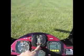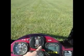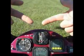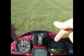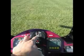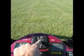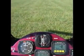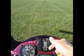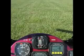Top center here is the combination engine and rotor RPM gauge. On the right is the engine RPM, on the left is the rotor RPM. The two needles work together and display in percent. Throughout the flight, the engine and rotor RPM will be up near the middle to top portion of the green band. Except when we go into the autorotation, the engine needle will drop to zero and the rotor will stay in the green band as we do our 180-degree turn to touchdown.